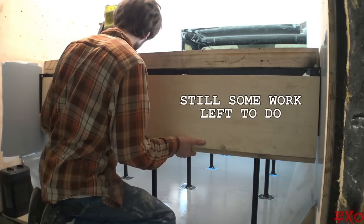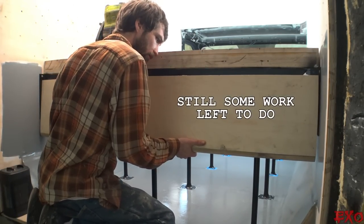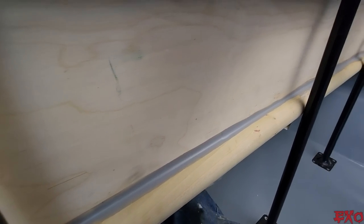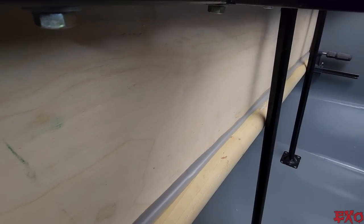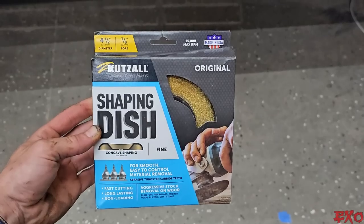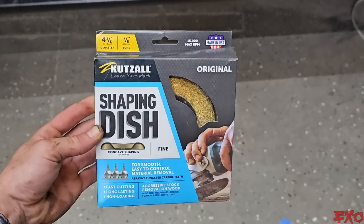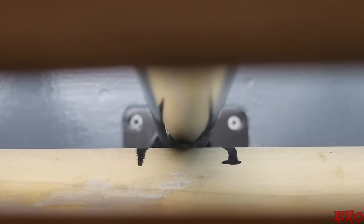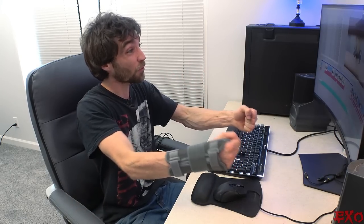Now for fitting back in, there's still some work left to do. Because the new port flare combines the roundover wrapping behind, the existing vertical braces are just sitting there begging for a high five. The port butts in directly against them, but without a quick shave job around the contours, the port won't fit in flush. So I'll take the angle grinder with a fancy wood carving disc and custom fit the roundover to follow the exact curves. That way we can bolt the port right into the braces going all the way across.